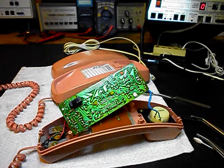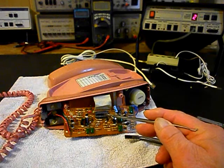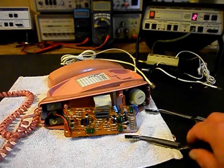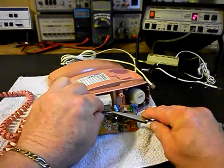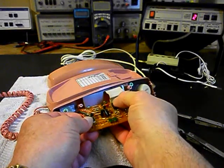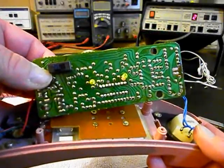Now that it's stable we can go ahead and solder the rest of our pins. We'll take a short break and be right back. We're back now and we have our socket installed - it's been soldered in. We have our old IC here and our replacement, the new IC. We're going to plug that IC in, making sure all of our pins are in the socket and push it down to make sure it's secure. That gives you a look at the solder side.